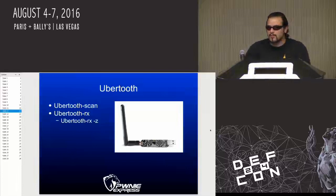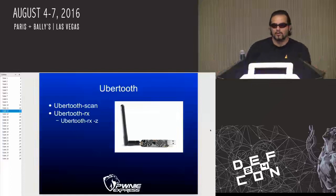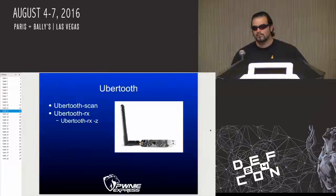But Great Scott Gadgets makes a product called the Ubertooth, and this is a true Bluetooth basic rate sniffer. It sniffs basic rate, which is kind of like to Bluetooth what 802.11b is to Wi-Fi. There are faster speeds, but somehow people always send stuff at slower speeds so you can see it. They can't sniff Bluetooth EDR, which is Bluetooth 2.0 enhanced data rate, with these, but that hasn't actually been much of a problem for us because everything kind of sends packets at a slower speed at some point